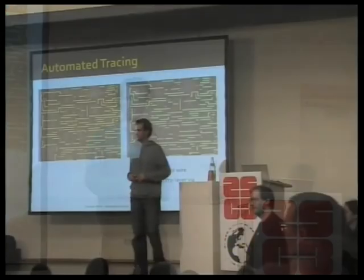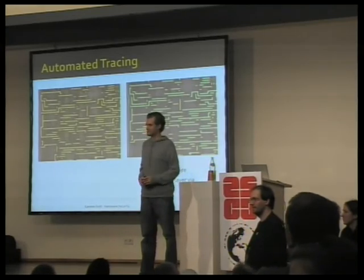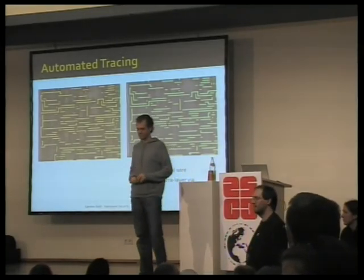Is it really as simple as you say to reconstruct the wires? Because as far as I know, there are at least 5 to 7 metal layers to interconnect the transistors there. That can be. I think the record is around 13, so anywhere between 1 and 13 metal layers. But once you have the process automated, it's easy to work with more than just a few layers. Fortunately, the chips we have been looking at are kind of older because they implement proprietary encryption, which has been known to not be a good idea for a while. They have had at most 4 metal layers.